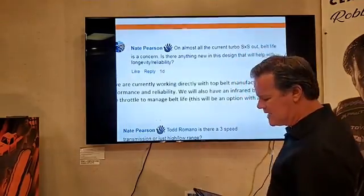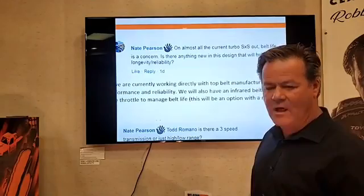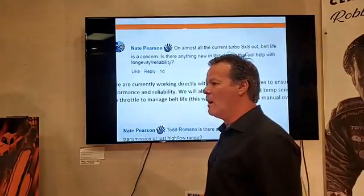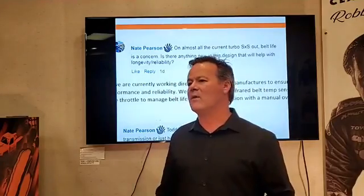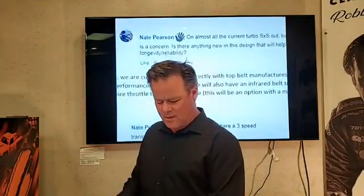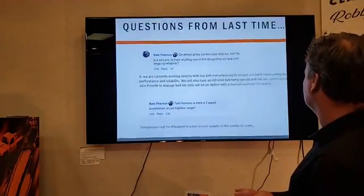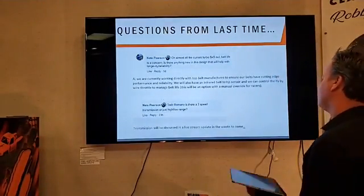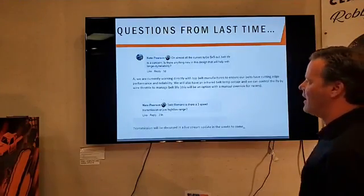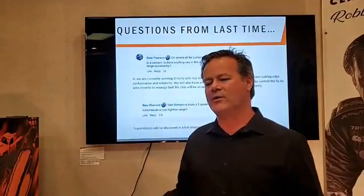On almost all current side-by-sides out there, belt life is a concern. Is there anything new with the design that will help with longevity and reliability? All right, so let's talk about belt life, and this will be another conversation we have when we talk about engines and gearbox, but I don't want to not answer your question. We are currently working directly with a top belt manufacturer to ensure our belts have cutting-edge performance and reliability. We will also have an infrared belt temp sensor, and we can control the fly-by-wire throttle to manage the belt life. Hopefully you understand what that means, but we've got fly-by-wire throttle on this engine.